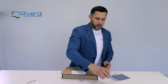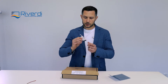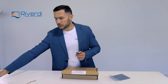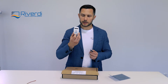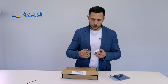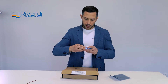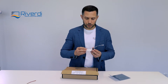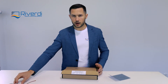The Molex cable for the board is included. The second cable is a Molex to IDC connector, which is a programming cable already prepared for the ST-Link programmer version 2 — the most common ST programmer on the market — which is not included in the display package. You can use this cable connected directly to the ST-Link programmer, then use the small Molex connector and connect it to the board to start programming the display, which we will show in another video.